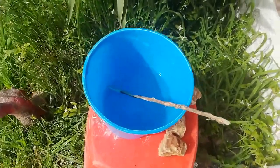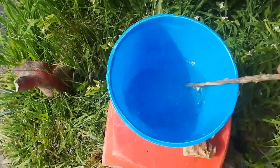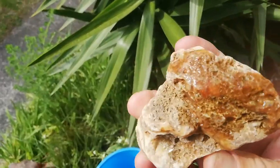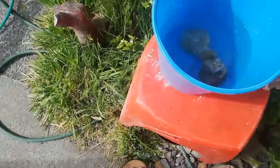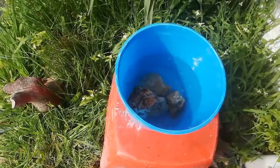In a spray bucket, we've now mixed up a mix of oxalic acid at 100 grams per litre, so it's just all nicely dissolved in there. We'll probably use this as a sample to see how well it's going to work. We'll put this big one in, put some more in, and come back in a couple of hours to see if it actually looks any different.